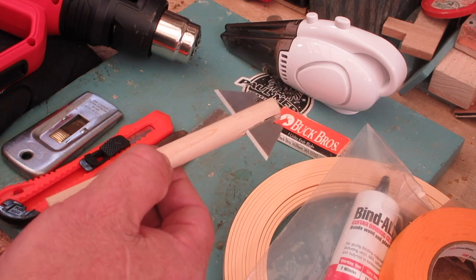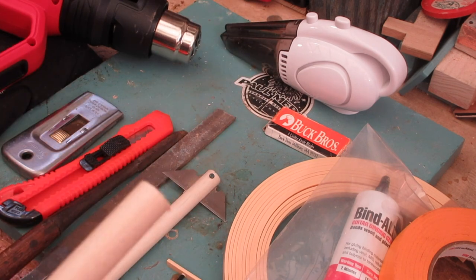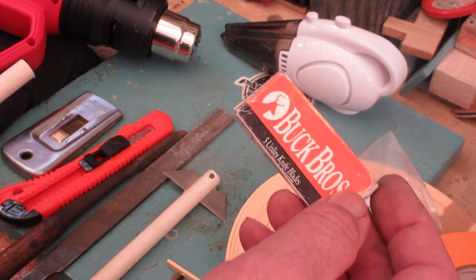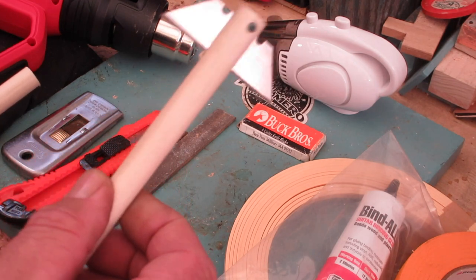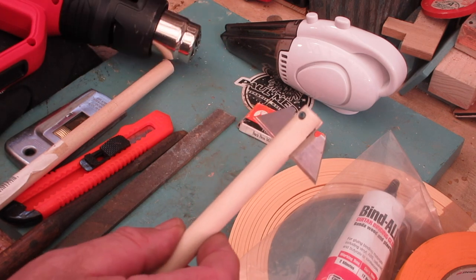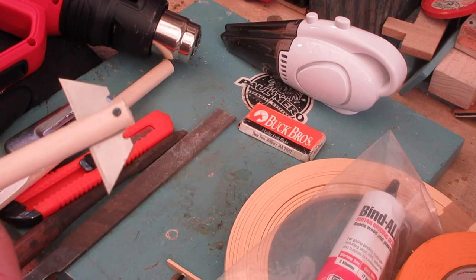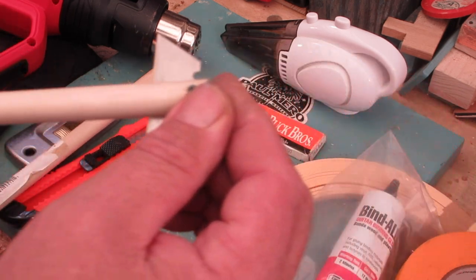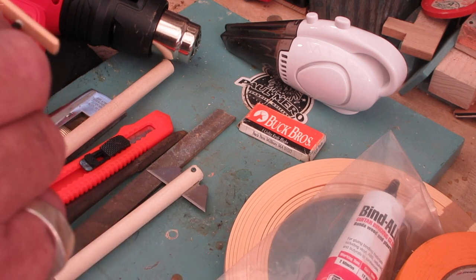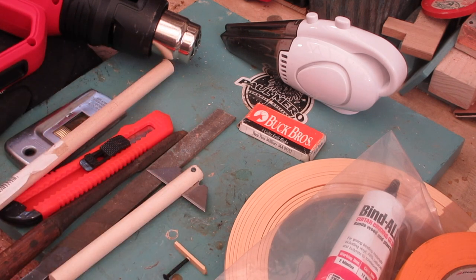I'm going to have to trim off the top of the binding once it's on the guitar. So what I did here was I just basically took a piece of rod. I run it through the bandsaw like this. I put one of these razor blades, like for a utility knife, in there like that. Drilled a small hole right there with the same size bit that we use for tuner screws, and then popped in one of our trademark chick flick teal screws. And what this does is it allows us to put our hand back here and move along the curve of the body when it comes time to cut off the excess, which is going to be up just a little bit from the body. So it allows us to use the body as a guide and to cut that. So these are the kinds of tools that we're going to need to do this job.